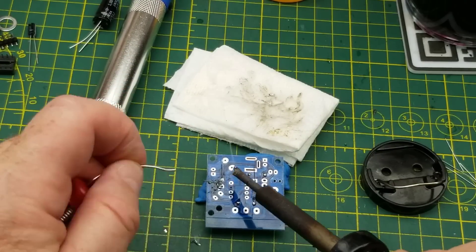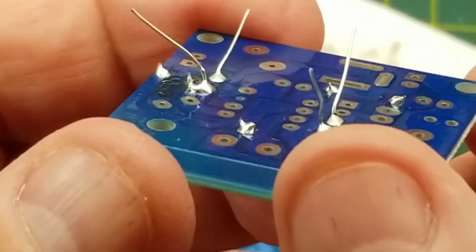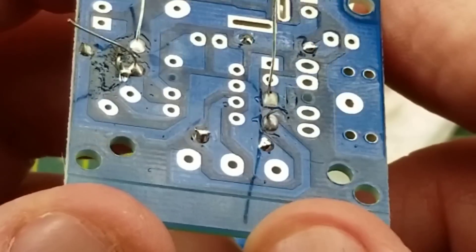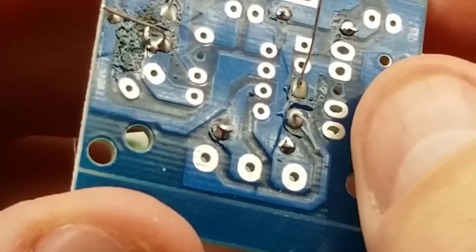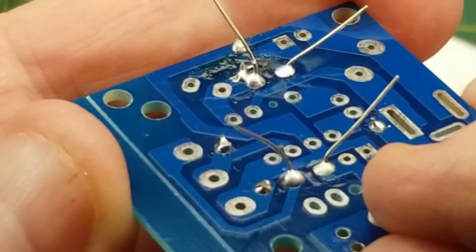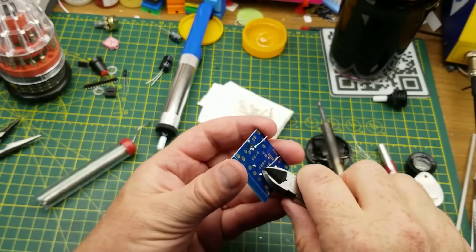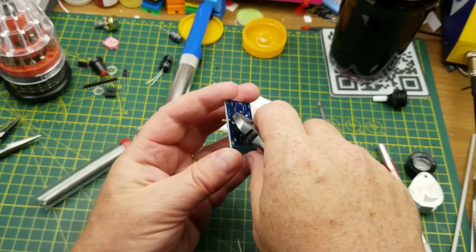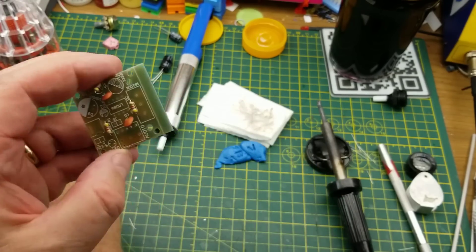I got by with this particular iron for decades, so I'm not surprised. Looking closer — nice little tented mounds. The connections I made are nicer, although they're not quite as shiny, which is an indication I was a little low on temperature. They're not crusty — if I was way too low they would look crumbly — but they do have a good connection to the pad and are tented up onto the wire, so I'm happy with that. This is what we're doing without the optimal tools, just working with what we've got.